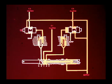Excessive restriction of the retard needle valve will cause the releasing clutch to be retained too long and will develop excessive engine load during the shift. Insufficient restriction at the retard needle valve will cause a momentary loss of power to the wheels because of releasing the disengaging clutch too rapidly.